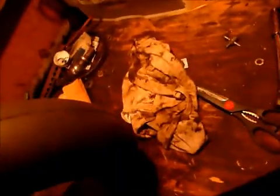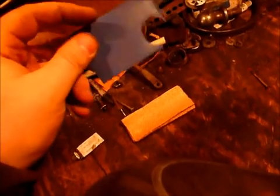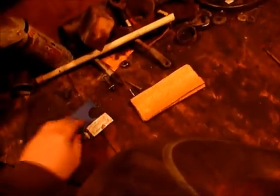Well guys, there's my leak. Right there. So anyways, I've already taken some sandpaper and have scratched up the area so that this tire sealant glue will stick. And I'm going to cut a patch out of this. This blue side peels off and then it's sticky. And it sticks on the tire. It works great for tubes. So it don't take long for the tire to leak down. I couldn't even actually find it again after it went down, but now I know where it's at.